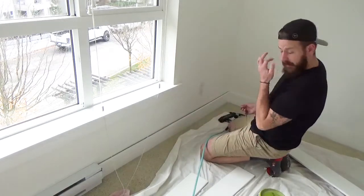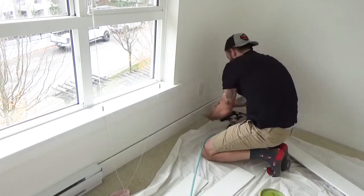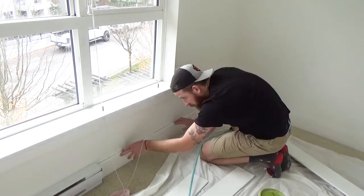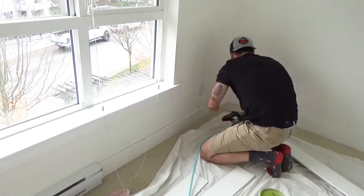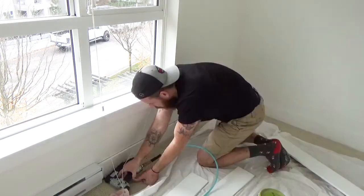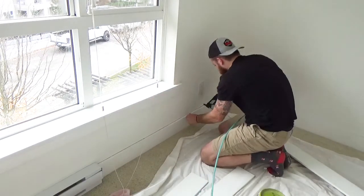I mean, you can do this with hand nails as well. You don't need many. There's a stud along the bottom, so that's the more important one. Make sure you press it down so it's nice and even. You'll hit the top bead with some caulking after, but above. Now I just push in on this side.